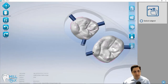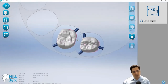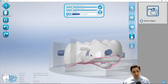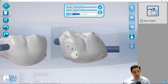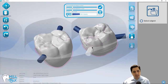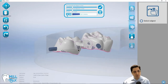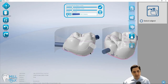For crown and bridge, those are the main items to look for: ensuring support pins are properly placed and margins are correct. I can't stress enough that placing support pins from the top view only is problematic — you can't tell where you're placing the pin relative to the equator line. Always use a 3D mouse or right-click to rotate to a side view, so you can see both the positional placement around the part and the height relative to the equator line. That will help avoid placing the pin too high or too far below the curve, causing additional undercuts.